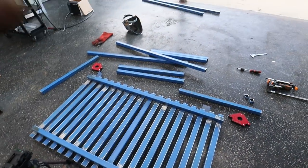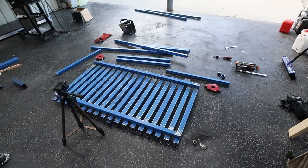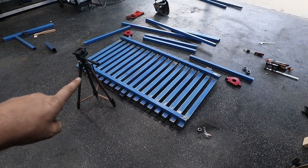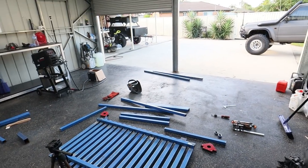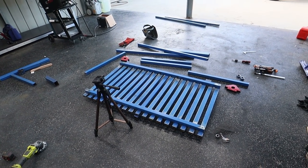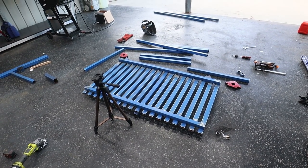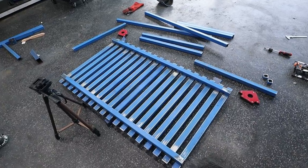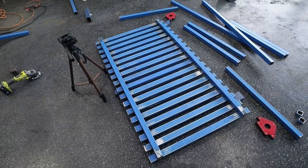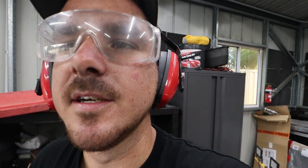Because it's getting late I've gone ahead and cut all the things I need to cut. I can already see that the top is bowed - I think it's from when it was sitting outside in the sun overhanging a little bit. I've cut one for the middle as well; we might have to jack it up, fold it back, then get the center brace in to stop it bowing again. It's now time to start piecing all the legs together and get them welded on, then we'll have a welding table.